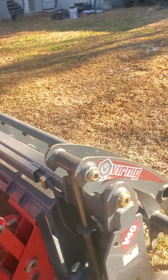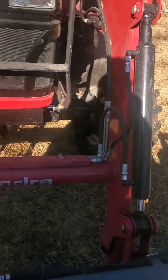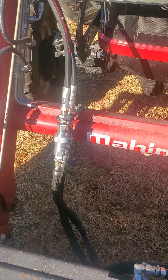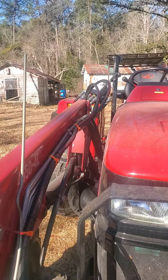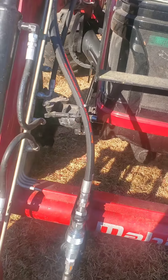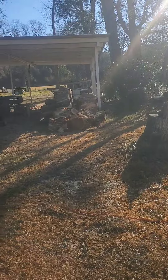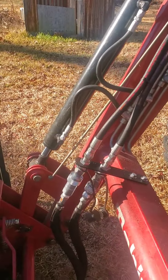As far as the fittings are concerned, I bought this Series 40 grapple used off of Craigslist and it had its own fittings — actually skid steer type quick connects, one skid steer type and one regular one. You can see how I ran it up through there — I just put zip ties on it with whatever zip ties I had. Check it regularly, make sure it's not leaking. You can see where I bled it on the tractor; I never cleaned it up — it went straight to work as soon as I got it done. I have big timber that I use it for.